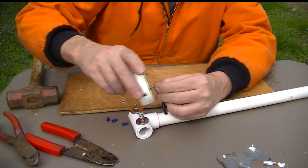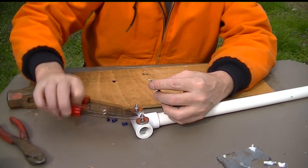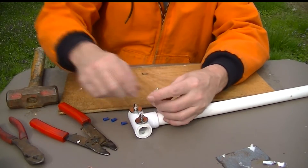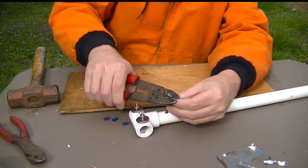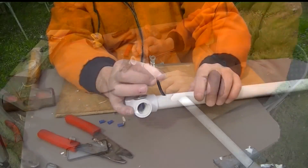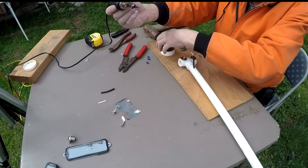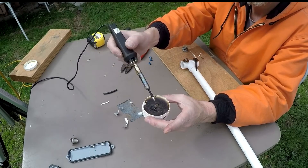Now we're going to put a crimp connection for mechanical strength. First we dip it in the flux because we want a little flux in there when we go to solder it next. Don't let any strays get out. Get the same amount through the crimp so that they are the same length — those will be part of the radiating portion of the antenna.